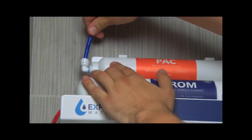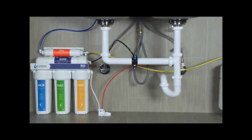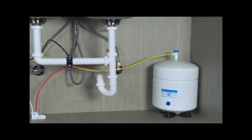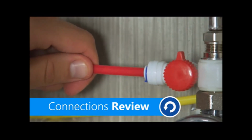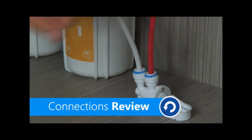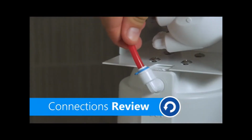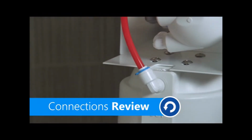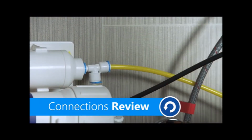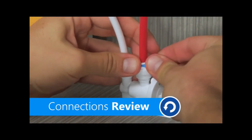Connect the blue tubing from the RO faucet to the PAC filter. You should have completed the other connections earlier in the video. Make sure all connections are complete and secure before moving on. Use red tubing to connect the feed water adapter to the in part of the leak stop valve. Use white tubing to connect the out part of the leak stop valve to the sediment filter. Connect the red tubing from the automatic shutoff valve to the ACB filter. Use yellow tubing to connect the PAC filter to the tank valve. Make sure all connections are secured with a locking clip.